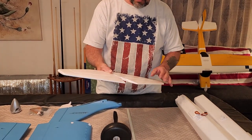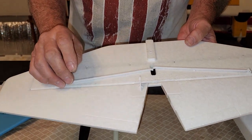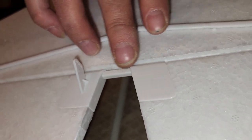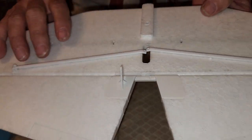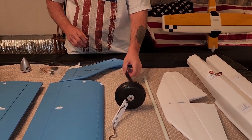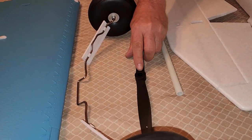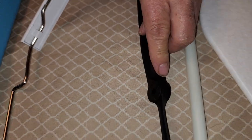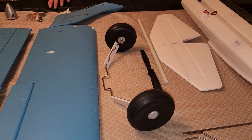The elevator is basically all white — I would have liked to have seen some blue on that, but that's alright. It does come with elevator struts. The control horn, like the Ranger, is a plastic molded one-piece unit that is glued on, so that's going to be good and strong. There's also the wing spar. The prop that comes with it is an 11x7, hex fitted for the motor. I'll have to check whether I can upgrade that to an 11x8, since the air in New Mexico is thinner and we like to use a bigger pitch prop.